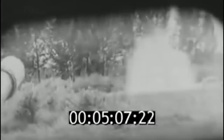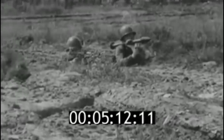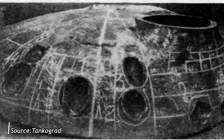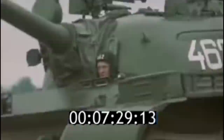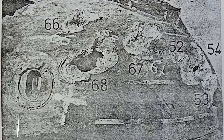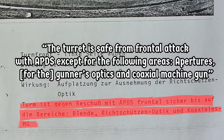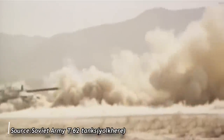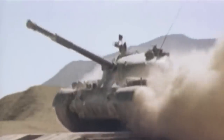Thanks to DM13's rather low tolerance to high impact angles, the hull sides were also fairly capable. If the hull was turned sideways by 20 to 25 degrees, the sides were only shot with overpressure test rounds, but from the available data it could be extrapolated that the sides could be safe from DM13 at a range of around 1,000 meters at those angles. The only penetrations were achieved with shots that landed directly next to the gunner's sight cutout, allowing them to burst through the side of the cutout and form cracks large enough for light to pass through. This led to the conclusion that the turret is safe from frontal attack with APDS, except for apertures for the gunner's optics and coaxial machine gun.